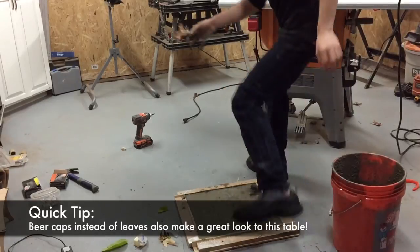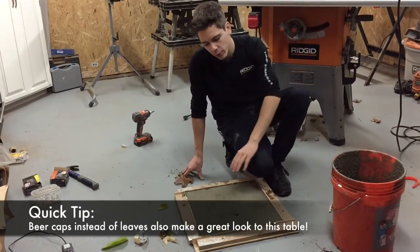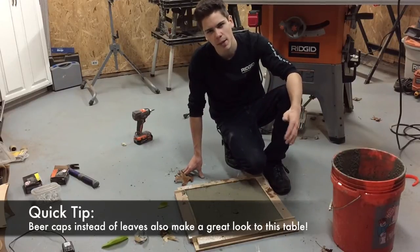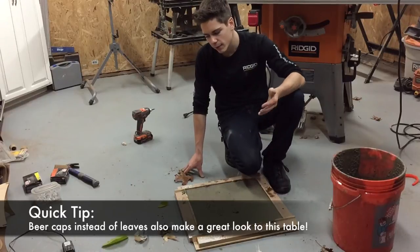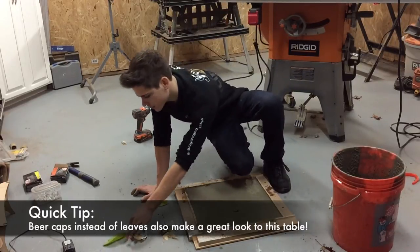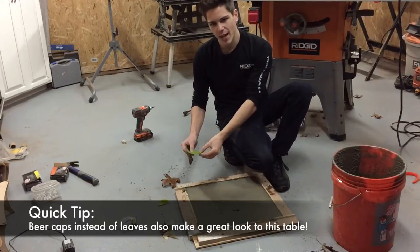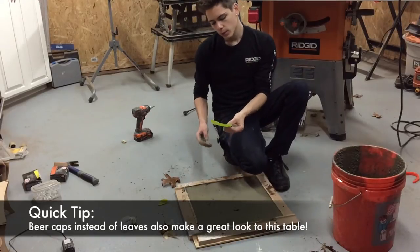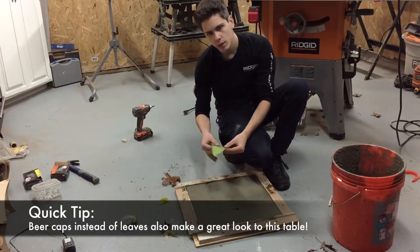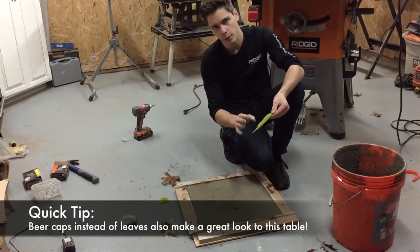We just poured the countertop section. Before adding the leaves to imprint on the concrete, we put some kind of oil-release agent down — you can use cooking spray, canola oil on a paper towel, or a sponge. I didn't have anything besides butter, so I used that. When you pick your leaves, I put around five in there — not too crowded. There are two sides to a leaf; one side has more texture. Since the bottom of the form is actually the top of the finished piece, put the leaves face-up with the textured side facing up and the smooth side down.